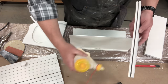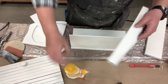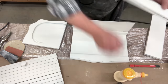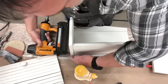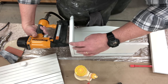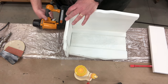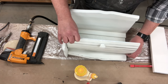Now that it's all sanded, it's time to assemble it back up. She's using a little Titebond wood glue, making sure the bread box is nice and secure. We were easily able to tap it out, and it was nice to be able to take it apart to paint each piece separately. After adding a little more Titebond glue to the sides, he's finishing this piece off by adding some brad nails to the thicker areas to make sure it's going to be nice and secure. As he's working along, if any of that Titebond glue squirts out, go ahead and try to wipe that off because it's rock hard when it dries.